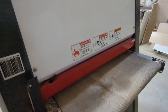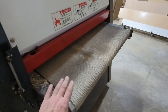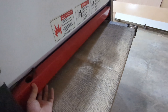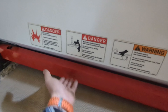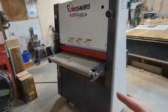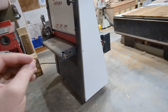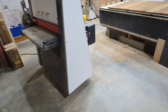It does have roughly between four and six inches of capacity, but I'm really in that two-to-four-inch range most of the time. This is the safety bar — if you throw something too big in there for an oversized load, it will turn the machine off. This machine is very, very picky about all those little tiny sensors and doing everything in the precise way. There have been a couple of times where I didn't do it in their exact way and had to restart the whole process all over again.